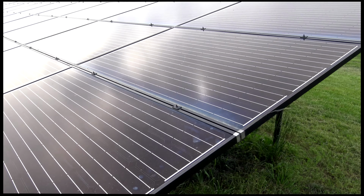In the spring, depending on when the pollen breaks out and if there's no rain, and it did happen this spring, you can get pollen that lands on this and it'll be like yellow, like it's painted yellow. And so the first time that happened, I thought, oh boy, that's gonna shut down power production. I went to check the meter, and I came out, brought a garden hose out here, washed it off, and then went to check the power again, and I had about 5% more power. So it was interesting because even though it looked like it was painted yellow and it would be a big impact, really the vast majority of the sunlight was getting through and still producing electricity. So, you know, a lot is being reflected, and that looks like a lot, but really wasn't that much.